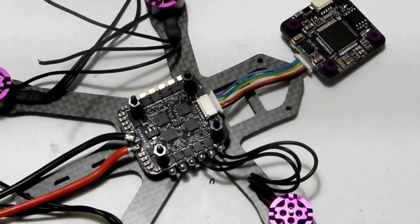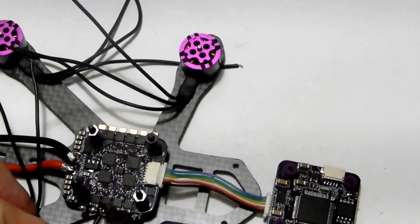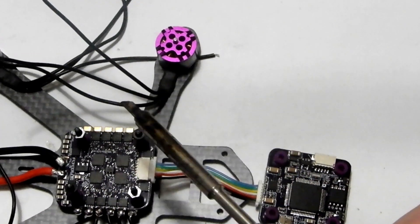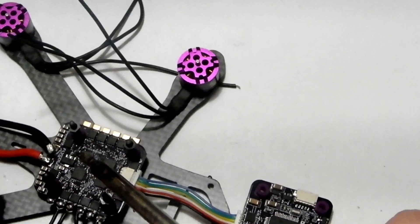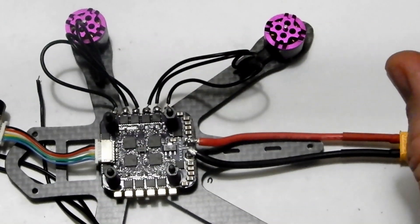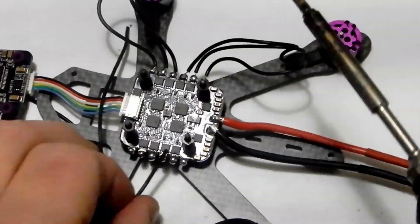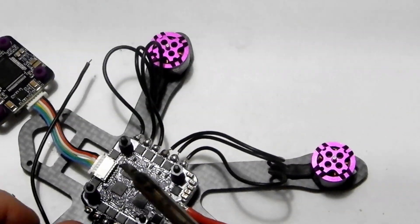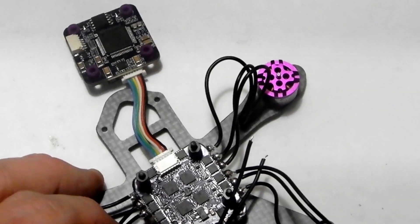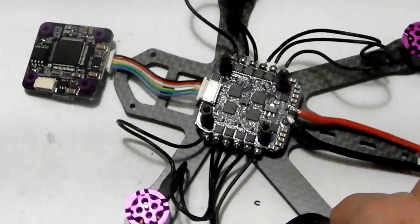Running at 370°C I can just make a quick touch and we're ready. As I got to the last pad being right-handed, that nut gets dangerously close — if you have it all the way down near the pad you're going to melt it, so keep it up out of your soldering area. I'm pretty consistent: I take the far right-hand wire and put it on the far right-hand pad for that motor, then middle, then left. What I end up with is motors one and four needing to be reversed in BLHeli, and two and three are naturally normal. That way I know exactly what to expect when I go in and check my motors.